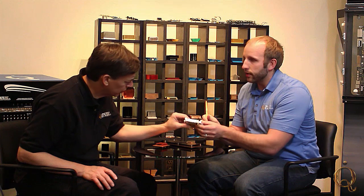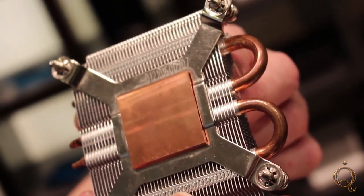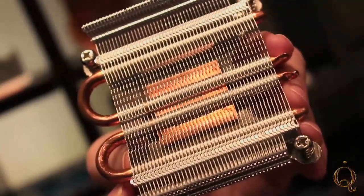The good thing about a zipper as well is if you were to stamp a fin for the zipper, you can also, during that stamping process, allow for holes in the fins to press in heat pipes. Here we have a tool for the fin itself to allow for the heat pipes. This is the base of the heat sink that touches the component, which is the evaporator section. The condenser section is the zippers away from the component, mounted to the board. The zipper fin profile allows us to reduce weight significantly, especially with a heat pipe application — it's very light.